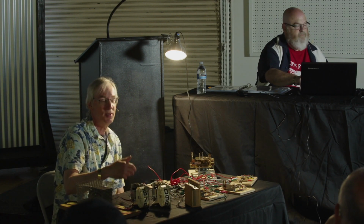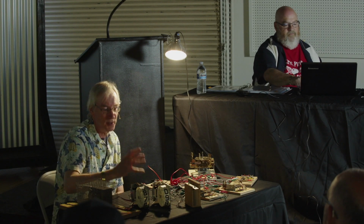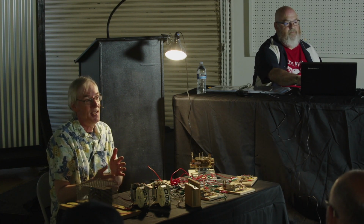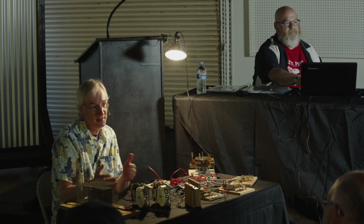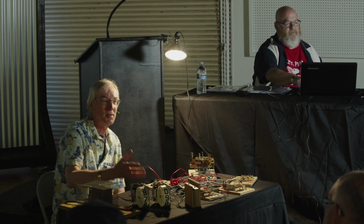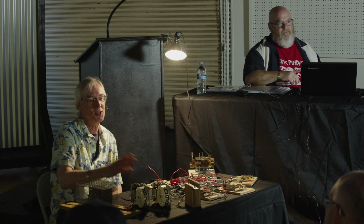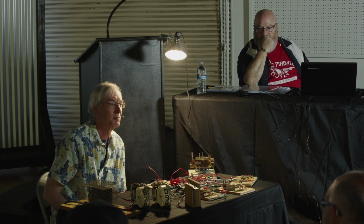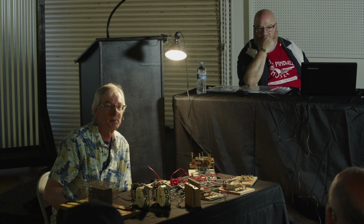I see. And it's often the one that, often the score reel hangs trying to climb that hill to 9 because it's trying to close one more switch. And if you're right there at the hairy edge where you need to clean the thing and it's got a little extra friction, sometimes 9 is more than it can do. Or maybe it takes 2 or 3 tries because there's one more switch that's trying to close when it gets to 9. That could happen with any number, it doesn't have to be 9.